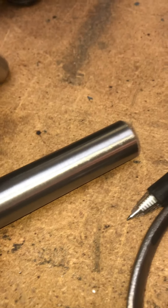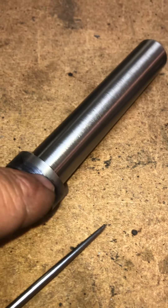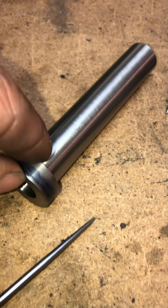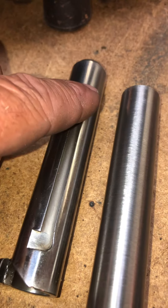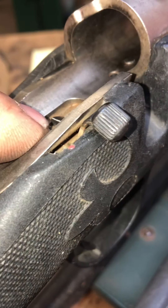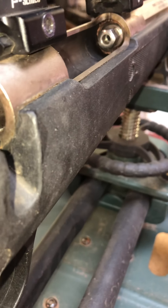So I need to make a handle and I'll weld it to this flange. It doesn't matter if the handle breaks off because this flange, this shoulder, is what's holding the bolt in. I'll copy this handle and weld it on there, and then I've got to put these tracks in the bolt. This is a guide to keep the bolt straight, and this slot allows you to open and close it over the trigger sear and the little ball detent that's up in here.